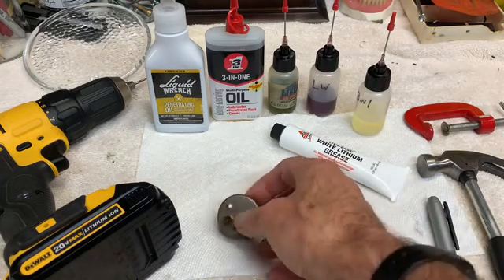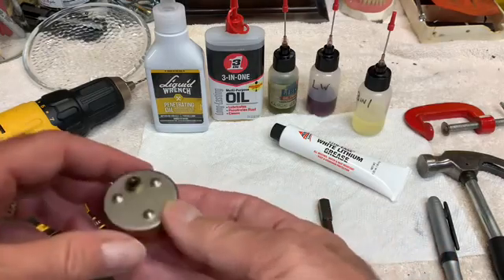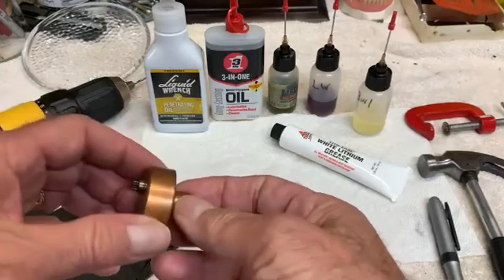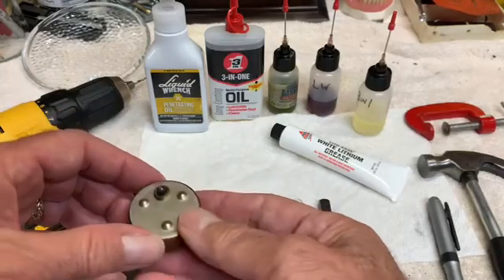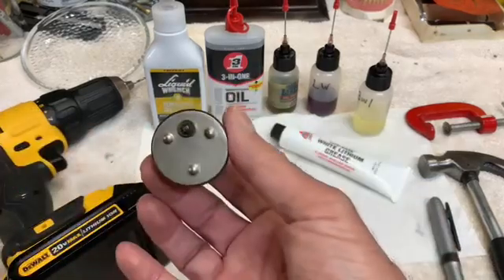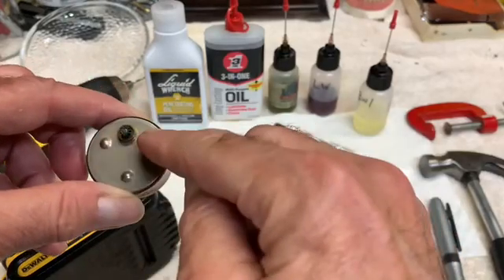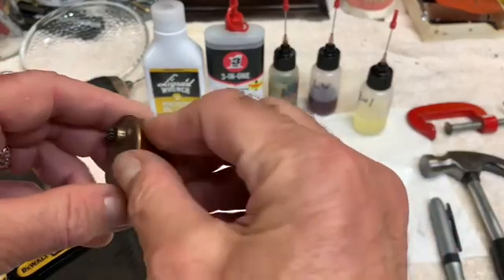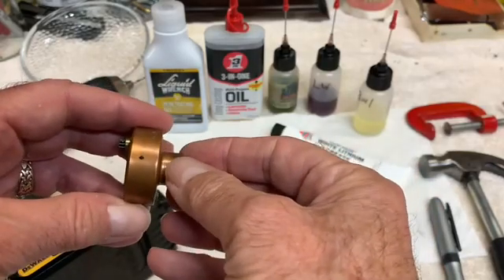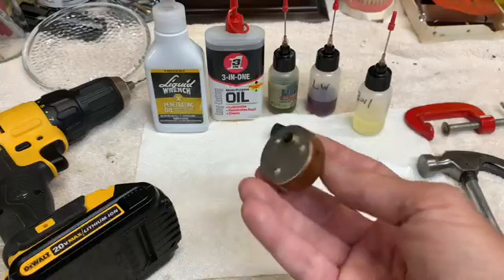What I have to do is drill a hole in the side of the rotor. The concern in doing that is there are gears on the inside, and you don't want to just pick any spot and drill in because you can damage it. My research has shown that if you hold the rotor with the output gear on top and locate the three dimples, move across to this one here, then turn the rotor on the side where I have this little black dot already made — that's where you're going to drill the hole.